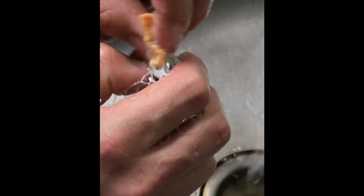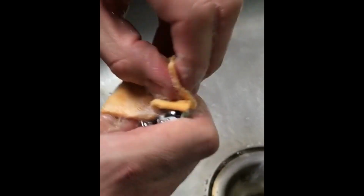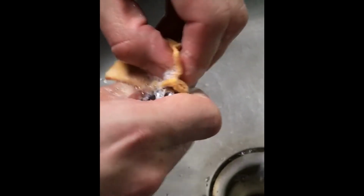The thing about this chemistry for gold plating is oil and dirt are the enemies of gold plating. Any bit of oil or dirt will interfere with the process, and you will not be pleased with the results if you leave dirt or oil on your watch. Even oil you can't see, like a fraction of a fingerprint, not good.